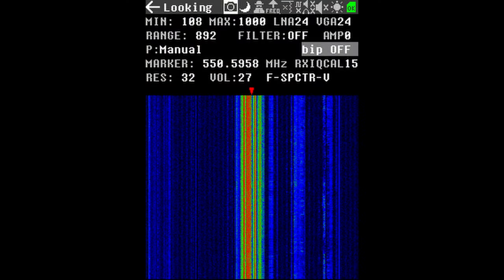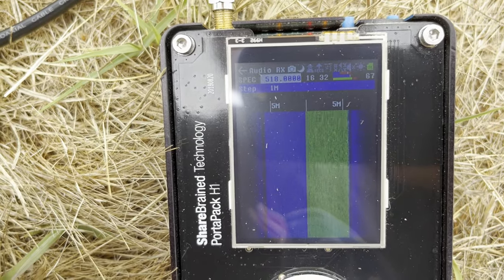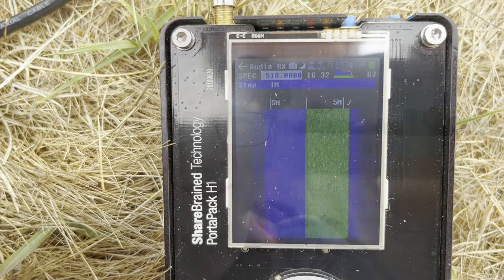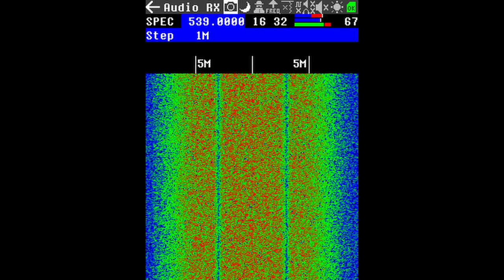In Looking Glass we can see a range of frequencies from 500 to 600 megahertz showing a lot of energy — everything else outside that band seems relatively quiet. When I switched to spectrum analyzer mode and tuned between 500 and 600 megahertz, I found several interesting things: it looks like there are three digital TV stations, and also some sort of very wide-band signal about 18 megahertz wide, which I suspected might be a cellular LTE signal of some sort.